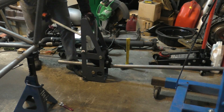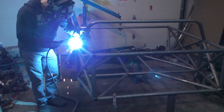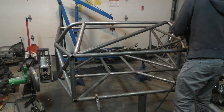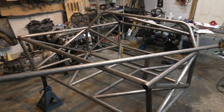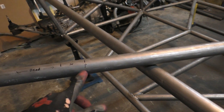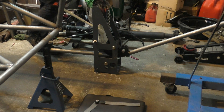On the plus side I got the front hoop right the first time. After it was done I notched the ends, welded it onto the chassis, got the angle right using a digital protractor, and added braces at the front to support the front hoop plus one transverse brace to prevent lateral distortion if the car rolls over. A few days later I got another tube for the rollover bar, marked everything carefully this time, and managed to bend it properly.